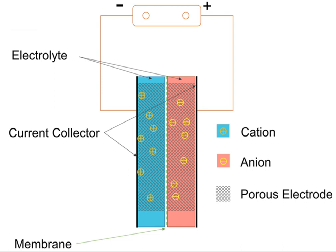The amount of double layer as well as pseudocapacitance stored per unit voltage in a supercapacitor is predominantly a function of the electrode surface area. Therefore, supercapacitor electrodes are typically made of porous, spongy material with an extraordinarily high specific surface area, such as activated carbon. Additionally, the ability of the electrode material to perform Faradaic charge transfers enhances the total capacitance.